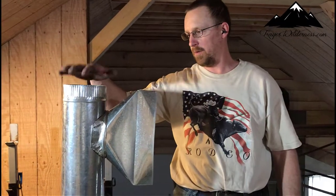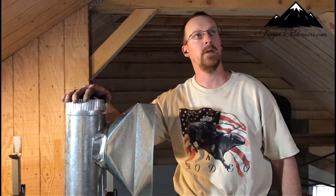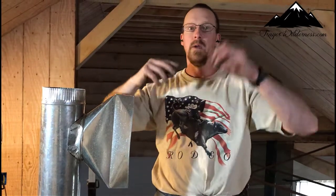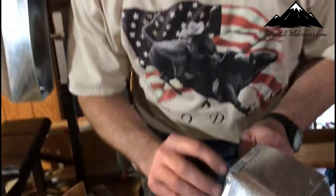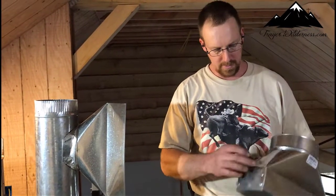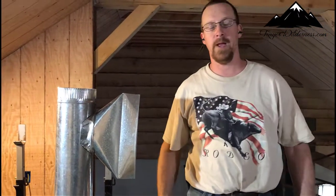It's one thing with this stuff, especially if you don't have high volume fans, you want to try and keep everything sealed up the best you can. There are little seeps on the back side of these, the way they're made. There are little holes here and here, on your corners. That one's a little bit bigger. So what I'll do is put some caulk on those little joints and places like that. It'll create a better suction for the fans.